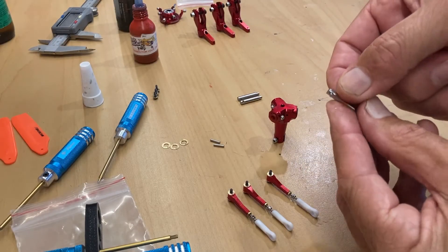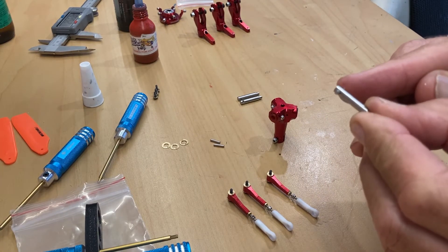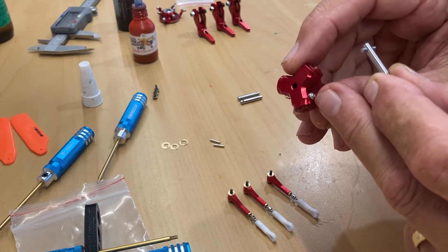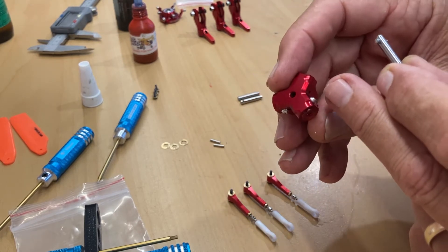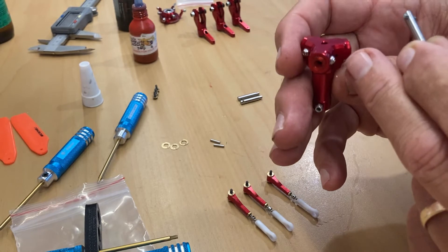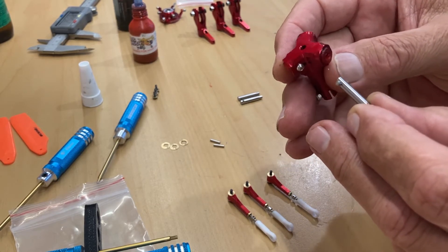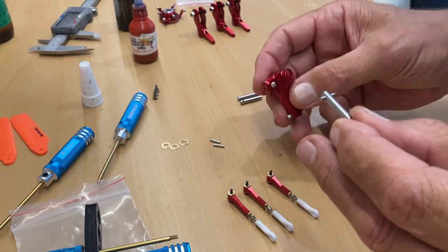That's quite a nifty design — the little blade grip stubs are held in with just a pin. That little pin pushes into the housing and is retained by a little set screw. So if you've bent something badly, take the set screw out — there's a little push hole on the opposite side — and you can just tap the pin out. Not being threaded is actually an advantage: even if it got a little bent you can get in there, give it a couple of taps, and pop it back out. Quite a nice assembly. I'll put a little bit of lube on all the bushes and then run through assembling all the pins into the head.